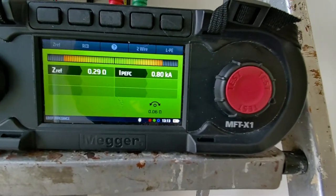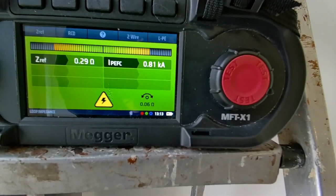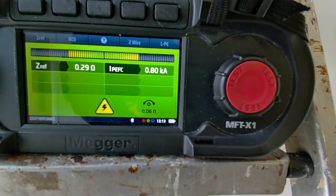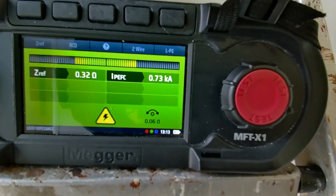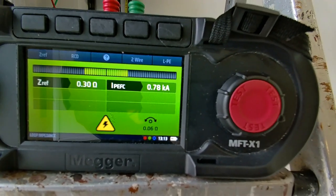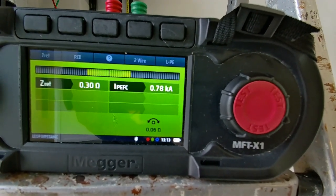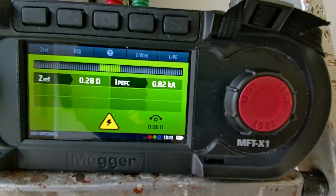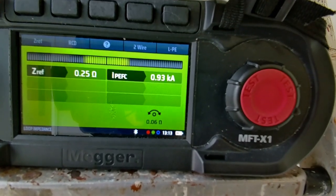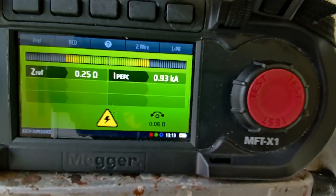That's going to gradually get smaller and smaller until eventually the tester will take a reading. That confidence meter is removing any uplift — earth uplift from earth noise, or any uplift caused by the RCD. It can take a little while unfortunately — that's the downside to this piece of equipment.